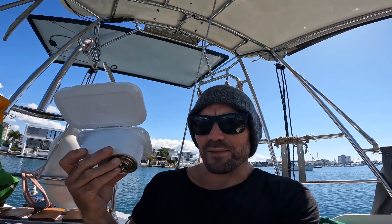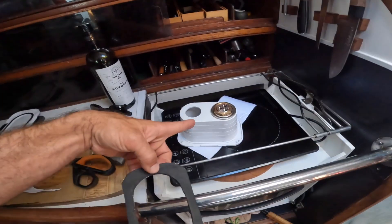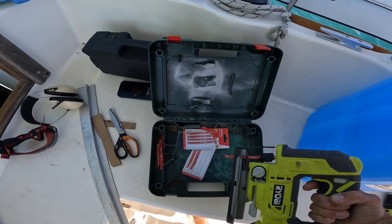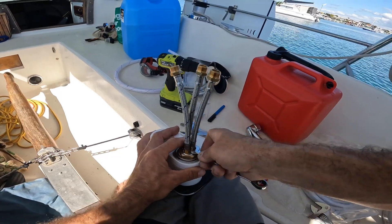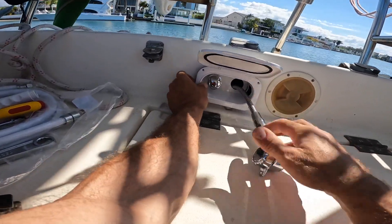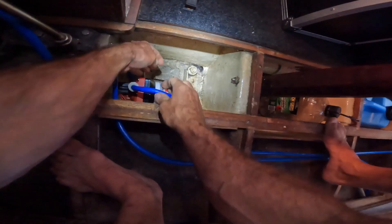No template - the most simple thing ever to make a product so much easier and they don't do it. So using marine-grade cardboard I fashioned a template. This thing also didn't come with any gasket so I've just doubled up some gasket material and made a crude one. Wherever possible with my plumbing I'm using John Guest fittings - I've used them before in the house truck build, they just click together, have stood the test of time, and I'm happy to use them again.